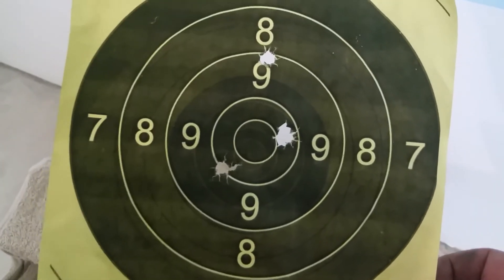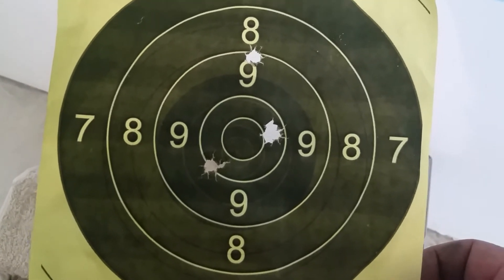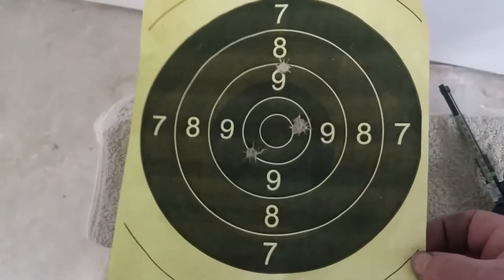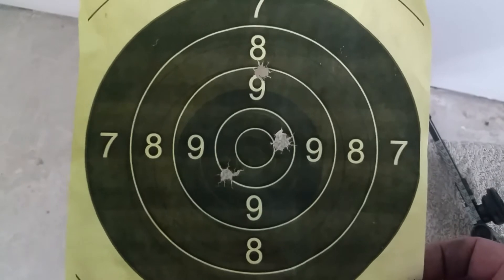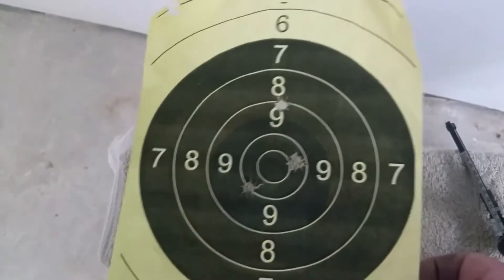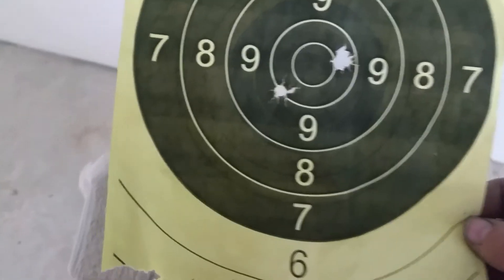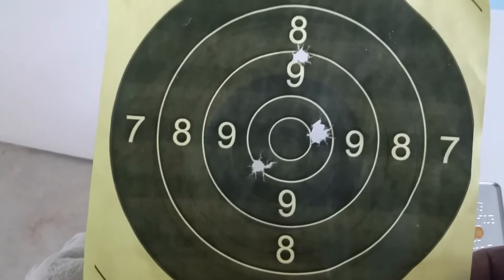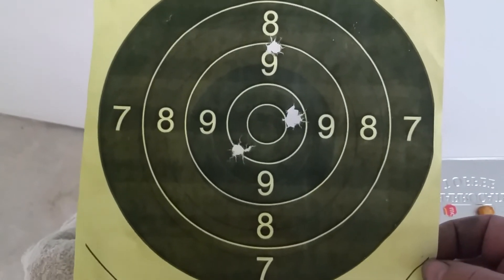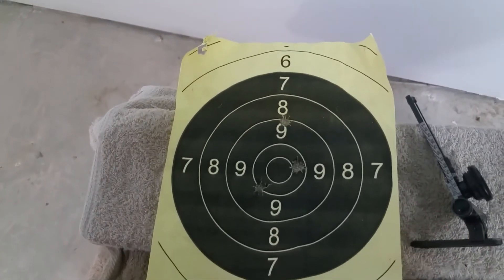Different powder charges, a different alloy for the bullet — probably because this was almost pure lead as far as I can tell, it came from some scrap lead I was given. Judging by the bullet weights from my Lyman bullet mould they came out exactly right, so it should be pure lead. Cal Tool and Die give you a bullet weight for a specific alloy of lead, and my bullets come out heavier than their quoted weight — so I'm thinking I'm looking at pure lead.